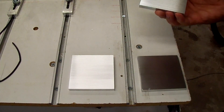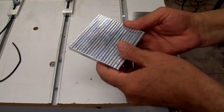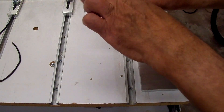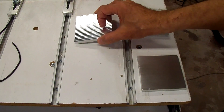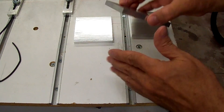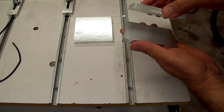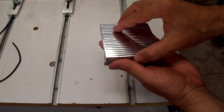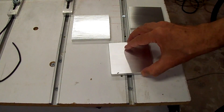I've got all three plates kind of lapped smooth. This one I left unlapped on the one side that's going to be the top side, which will be milled down further for the custom part. This is the base, lapped around the edge and the surface here. So these two will be going together like this and then this one will mount on like that.